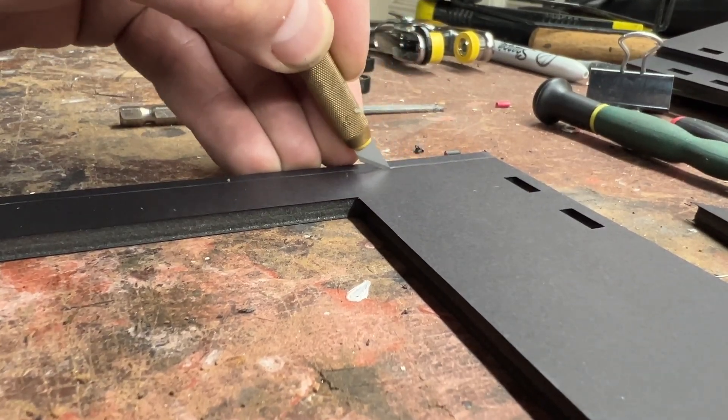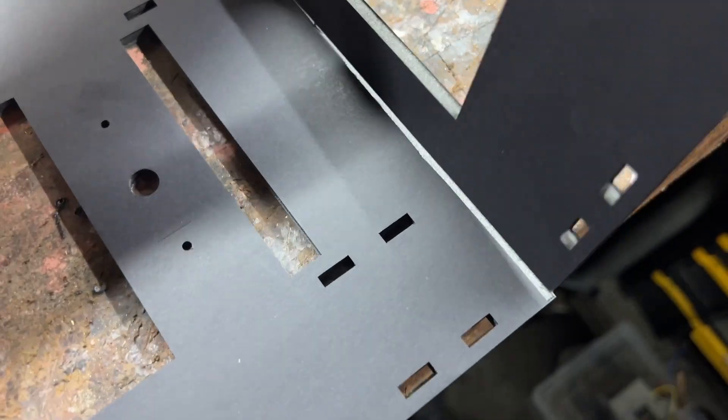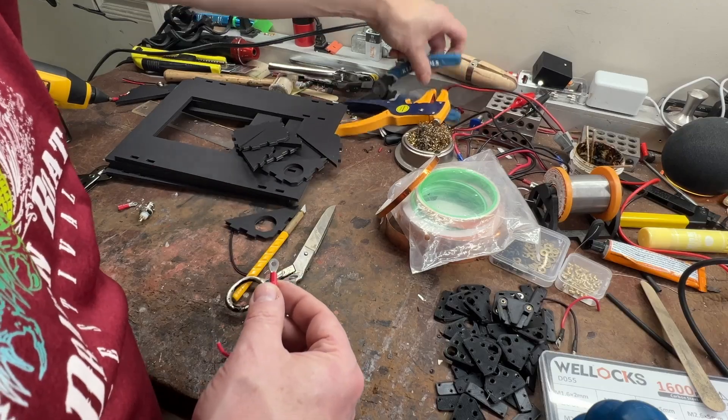One of the first things you're going to need to do is take a three to four millimeter cut out of the edge of a couple of these panels. What that does is allow you to do sort of a tongue-and-groove or miter joint, and you can hot glue everything together via that. Take all these pieces and slowly but surely hot glue them together and make this structure completely whole.